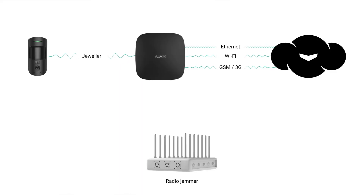Another way to jam would be disrupting the Wi-Fi signal. This is way easier — you can buy the tools online and it's not that hard. Think about how often Wi-Fi goes out during a day or week due to weather or other issues. If Wi-Fi is the only communication tool on your alarm system, that's a problem, because if you lose Wi-Fi, your hub cannot send notifications to your device anymore. Devices may still communicate locally via radio, but they won't reach the cloud to send you a phone alert.